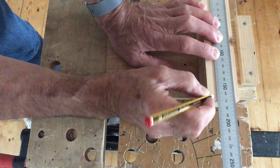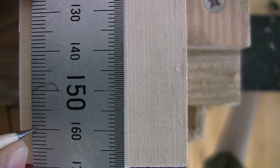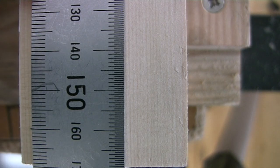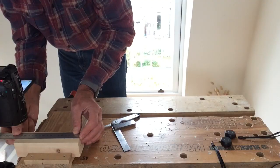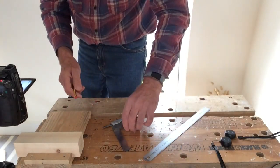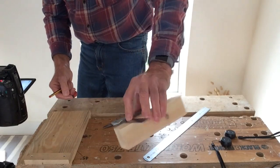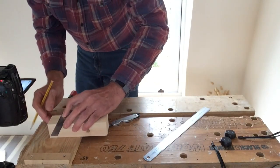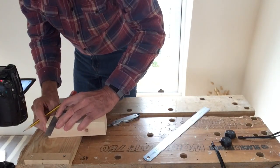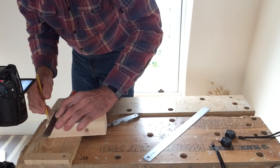With your remaining fingers, place that pencil point exactly on 160. If you move the steel rule up a little bit you can see the mark is pretty good. Then put your square onto the work — holding it three fingers, one finger, thumb — pick the piece of wood up with the square and draw a line through that dot. It should be a really faint hairline.